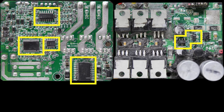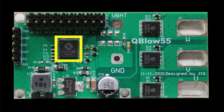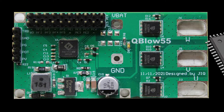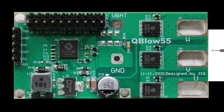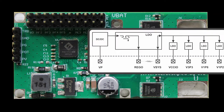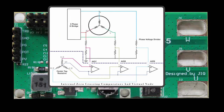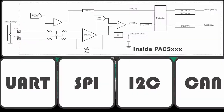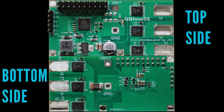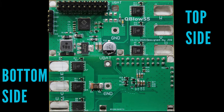So here is a funny question: what if I could take all of these semiconductor devices and package them all into a single device? Enter my reference design, the Q-Blow 55, revolving around a PAC5523 device. This little guy has everything we need to drive a three-phase BLDC motor — an outstanding M4 32-bit microcontroller, the gate driver, a DC-to-DC converter to step down from 40 volts to 12 volts, LDOs to generate 5 volts, 3.3 volts, 1.8 volts, and 1.2 volts, differential amplifiers to measure currents, single-ended amplifiers to extract rotor position, a powerful ADC with a sequencer, and much more. Other than the six N-channel MOSFETs and a bunch of diodes, everything else is inside the PAC5523 device.